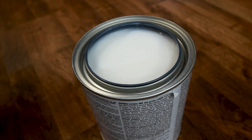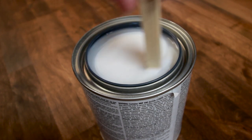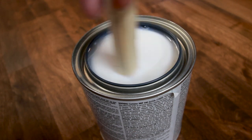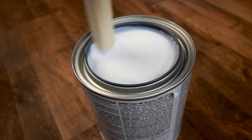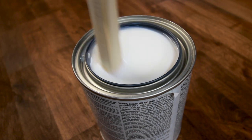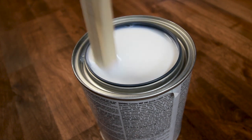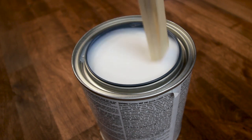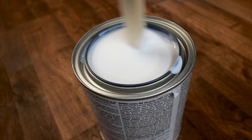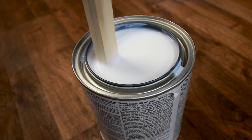And it turns out that this finish, when we follow up with the buffing that we're going to do with some steel wool and some other things like that, you end up with this really lustrous matte finish, or semi, not really a flat matte, but a little bit of a satin, and it gives you the look of a little bit of age, a little bit of wear, and avoids that glossy plastic look that almost everybody associates with polyurethane. And it's become one of my favorite finishes for anything that I really want actually protected by polyurethane.